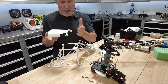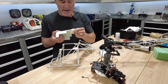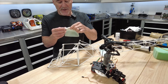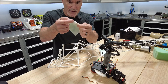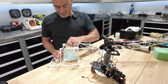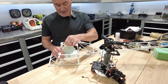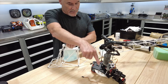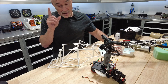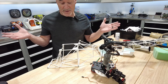I originally taped these little support pieces to the top of the tank as recommended, and tested it, tested it, tested it. When I was ready, I glued them. These little nuts that you slide into the slot and then secure — that's fairly ingenious — but you have got to mess with the angle on the tanks in order to get them far enough away for the main gear to spin inside. I've got one piece of paper's width on each side and it doesn't touch.